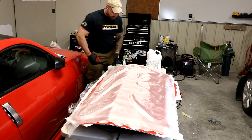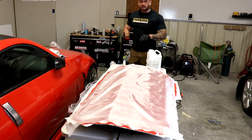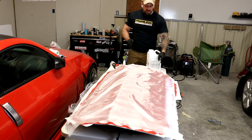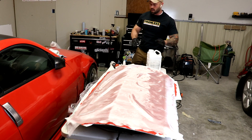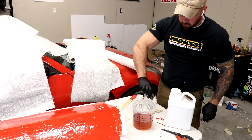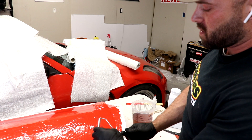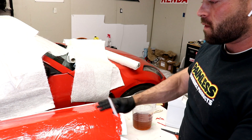When you're dealing with carbon or fiberglass, you definitely want some dedicated shears — it just makes your life easier. I'll take my mat, measure it out, cut it up and get it ready before mixing up the resin. This stuff cures much more quickly at higher temperature, and because of past experiences I want to make sure everything is prepared before laying it down. You want to get one of these metal rollers — the resin doesn't stick to it and you can clean it with acetone. It allows you to push out any air bubbles to ensure a really good form-fitting product.